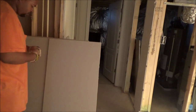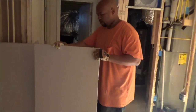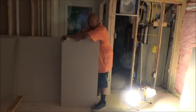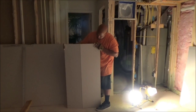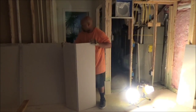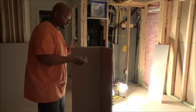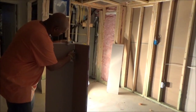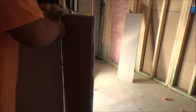Once I cut that paper side, fold the knife, bring it out here, put my foot in front of the piece, put my arm in front of the other one. I mark where the cut is made and give it a nice little punch. That bends it. Then I grab the knife and cut — bottom to top works better for me. I start from the bottom, just cut along the seam that I just broke, until it meets the top.